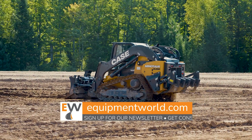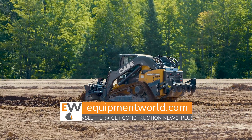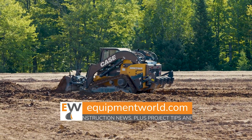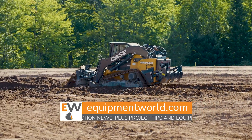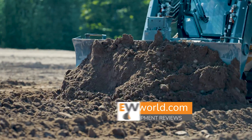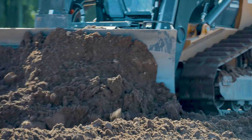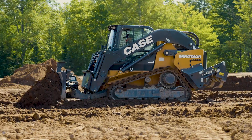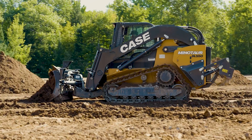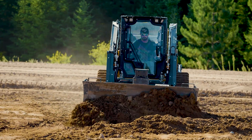This is the new product category that Case has created. It is a true dozer-skid steer combination. A traditional dozer blade that goes on a skid steer doesn't have any real coupling to the frame of the machine, and therefore it's always been a relatively ineffective grading tool. With the Case DL 550, or the Minotaur, they actually have a C-frame that pins to the frame of the machine, which really does turn this machine into a small dozer. This is a really capable, really versatile grading skid steer-dozer combo machine. It absolutely lives up to everything it was promised to be.